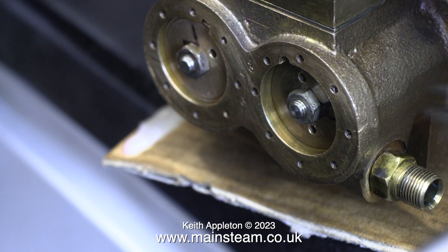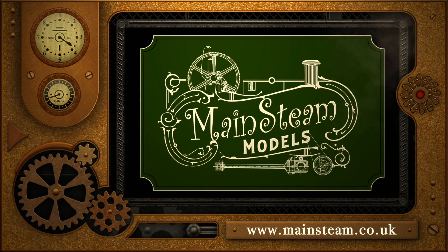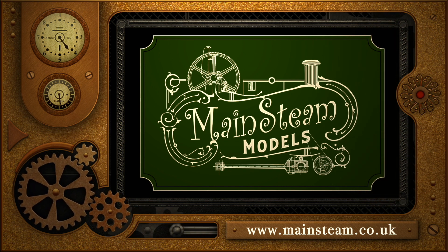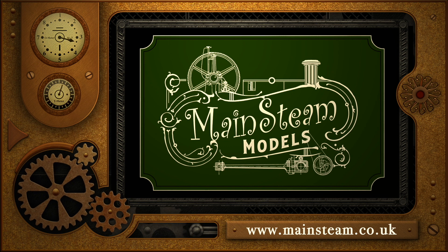I don't want to be picky because this pump is very well made, but the piston rods are a little bit too long. In fact, when I first ran this pump I could hear one of the pistons making contact with the cylinder cover, but the knocking could be due to incorrect adjustment. That's it for now — stay safe, stay healthy, thanks for watching and I hope you found it useful. Please take the time to visit my Mainsteam Models website and click on the Video Playlists section, where you can find other videos you may like to watch and view them back to back.